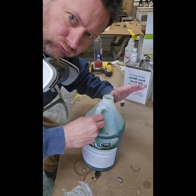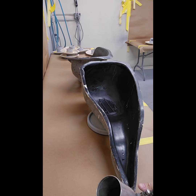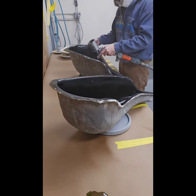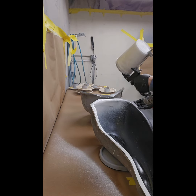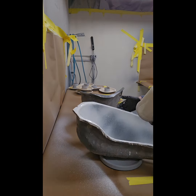This is the release agent we use — it's a great release for this type of mold and we're going to be spraying it on here momentarily. We're using a 1.0 nozzle for a nice mist. We'll do two different layers, letting it dry in between before putting on the next coat.